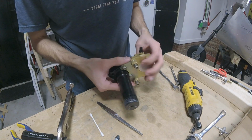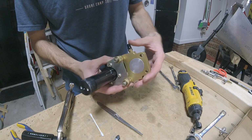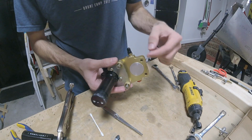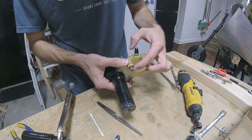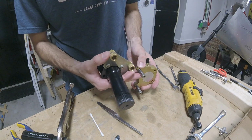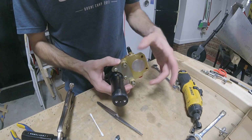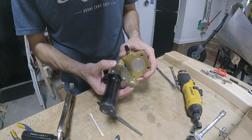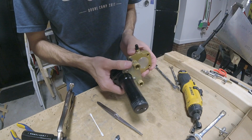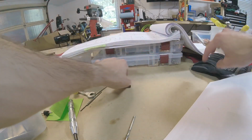Okay, so I guess if it seems like these are tight and something is off and it's not wanting to slide, just put both of them in there and then loosen the bolt and the nut here so that this little guide rod has some play, and then you can line up, and they'll align themselves when they're in there. So beautiful. I like it. I was really worried there for a second that there was something wrong, like something bent.